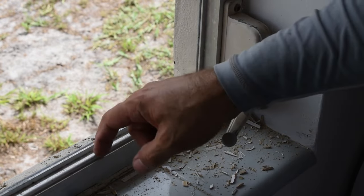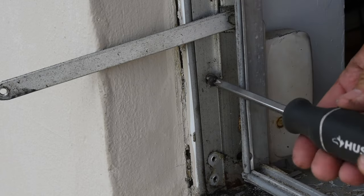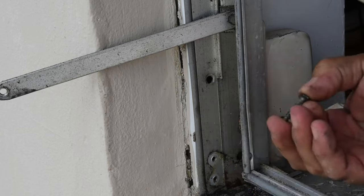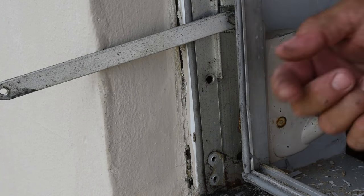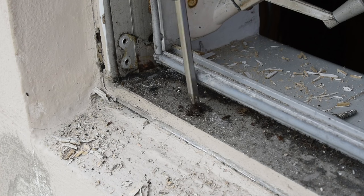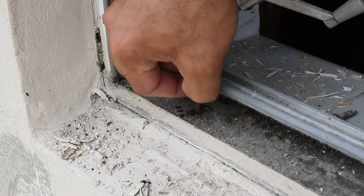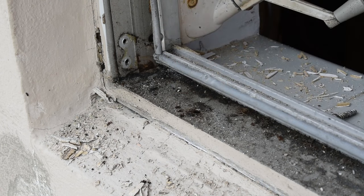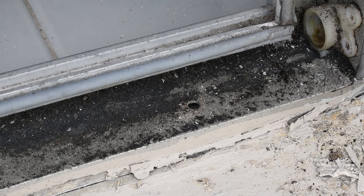Next, you're going to remove all the screws that are in the frame. Over here there's one screw — this goes directly into a pressure-treated 1x2. There are three of these on each side: one here, one in the middle, and one at the top, and I have to do the same on the opposite side. There are two screws in the bottom and they're generally pretty corroded — I had to pry this one out because there's just a lead anchor in there. We're now almost ready to remove the entire frame from the concrete block opening.